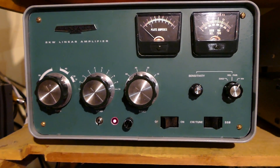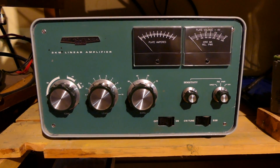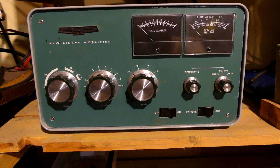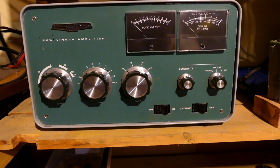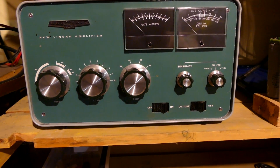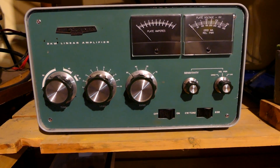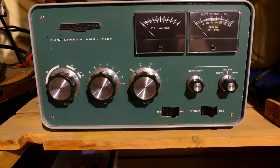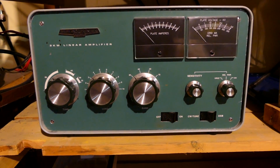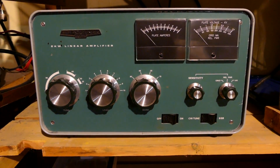The reason I started working on this was my contesting amplifier — this is my contesting amplifier. I purchased this one in 2006 and have been using it in very intensive radio contesting use. It's an SB221. It had 1995 date-stamped EIMAC 3-500Z tubes in it, and about a month ago it packed it in. It just died. So I opened it up and found a blown resistor on one of the grid pins on a 3-500Z tube, and the 0.82-ohm metering protection resistor on the Harbach board had failed as well. There was definitely something wrong with one of the tubes.